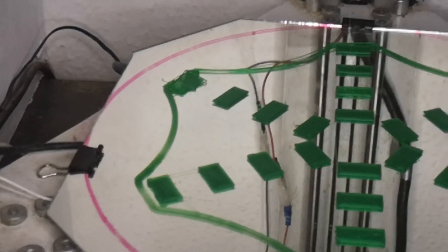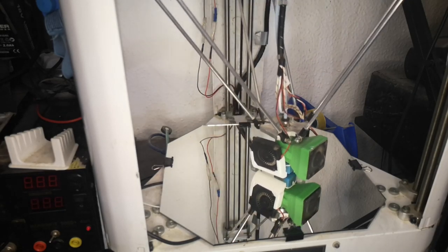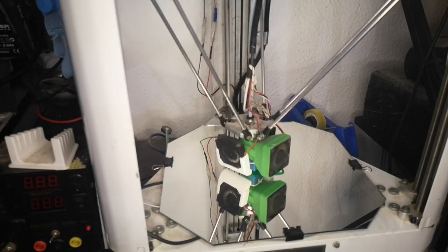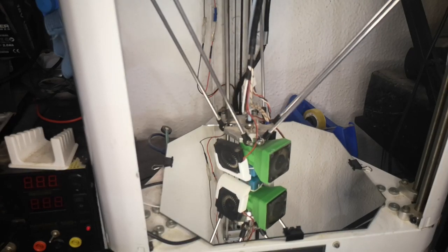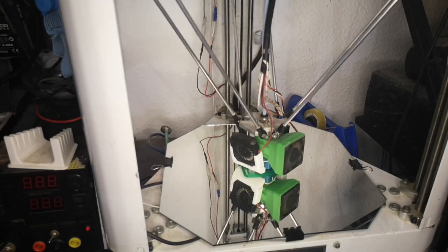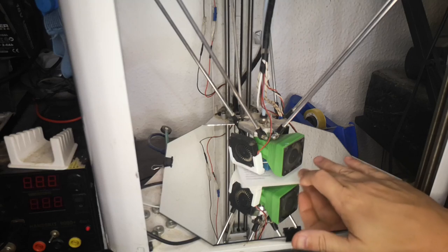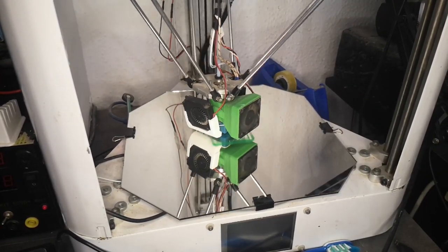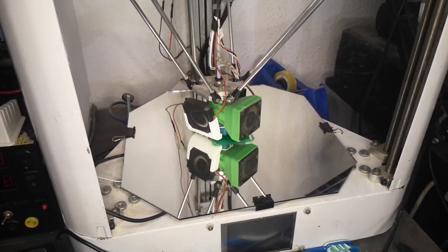You can see where it's almost transparent - it's too close to the bed so it can't squish out more filament. On the other side it's the opposite - too far away. So it's a little tilted. I did the mesh leveling off camera and it's a little better now. First attempt had no filament - the head got blocked - so I started again. This time it actually printed but I was too far from the bed. Attempt number three still too far, so I lowered it down by 0.10 millimeters.